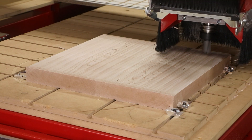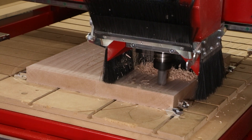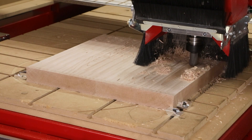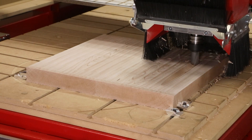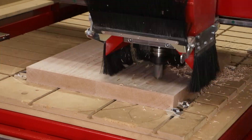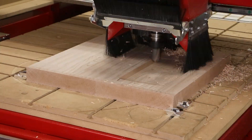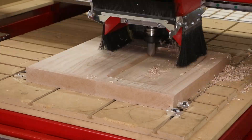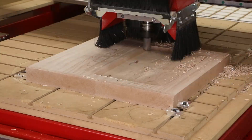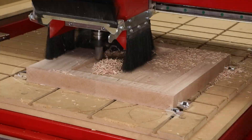This seat variation will turn out to be a square shape, and to cup out the seat we're actually going to 3D carve a cup shape running in both directions. This will leave the corners proud while the edges and center of the seat are dished in. The depth of this dish is three-eighths of an inch.